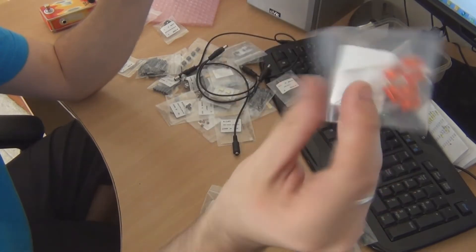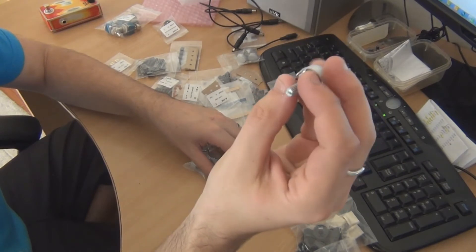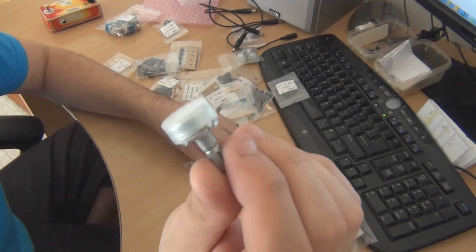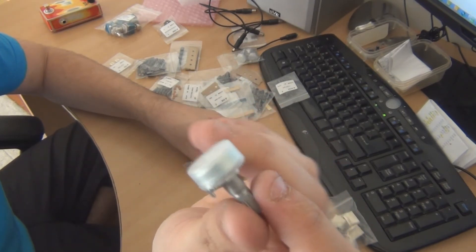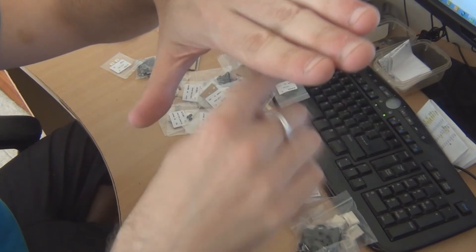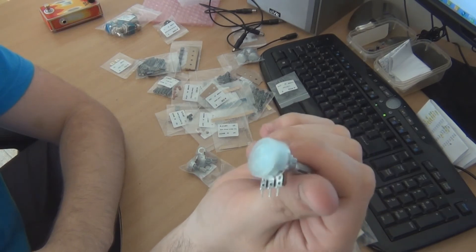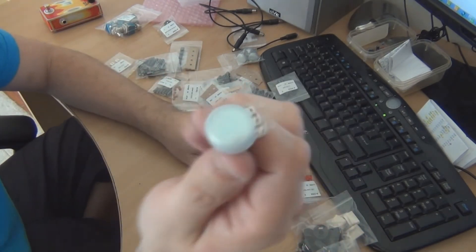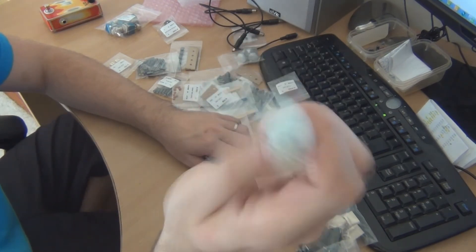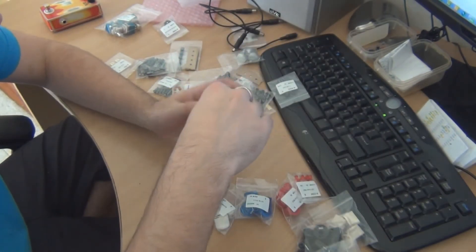The diffused red LEDs are very cheap — they're only two cents each. Now for something a little bit different: the pots come with plastic backs on them. If you're new to building guitar pedals that can be handy, because generally the back of your board sits on top and underneath you've got all your solder joints, and the plastic backs stop things from being shorted out — it's kind of like a protective cover. That's a nice touch. They throw the plastic covers in and they're cheap — about 50 cents each, even cheaper than Futurelec.